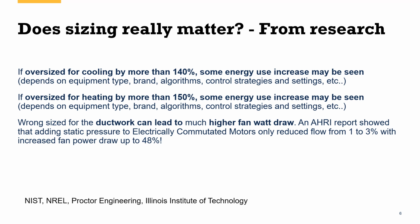And the reason why is around 2017, the federal minimum standards, so this is the Department of Energy and others in the federal government who set the standards, came out and said, at this point, all manufacturing must meet ECM fan motors in our central air handlers. But they gave, I believe, 18 months to 2 years for distributors and manufacturers to sell off the product they had already made. So even though the rules changed in 2017, the sell-by date was in 2019. So that's why I kind of put it that way.